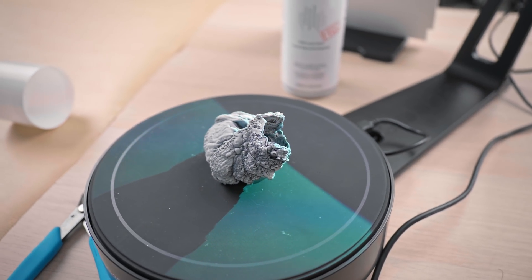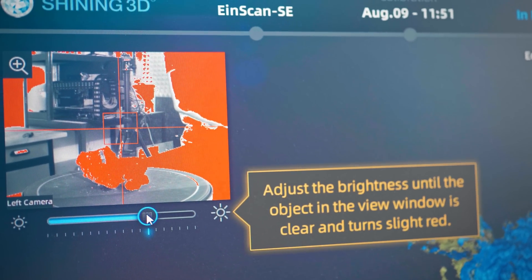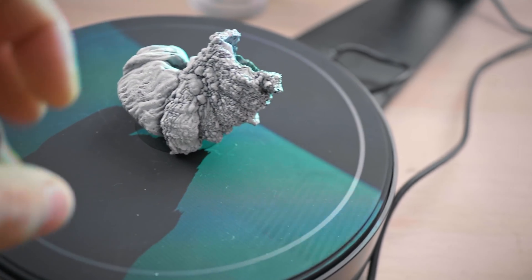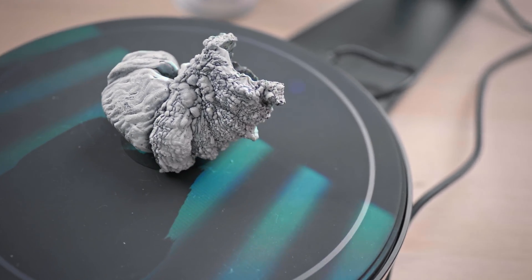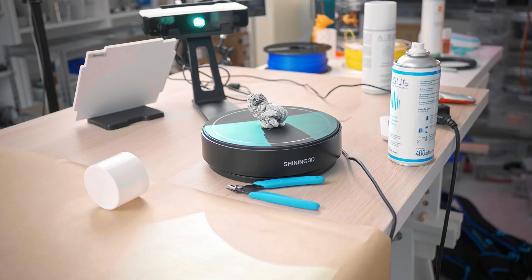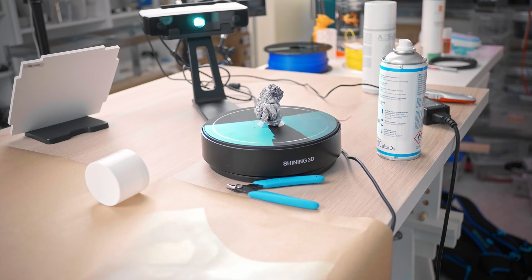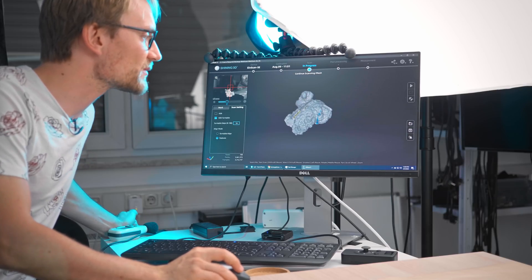So let's go ahead and start the scan and see if it's any better. One thing we can see right away is how much more light this is bouncing back, so we really have to dial down the exposure so we're not overexposing the entire thing. If this stuff wears down during the scan, we can always apply a new layer because it's still gonna be the same geometry. Look at that detail! I am impressed. That was roughly about half an hour of scanning — I did a few re-applications of the scan spray to cover the internal corners. The resulting scan is pretty good.